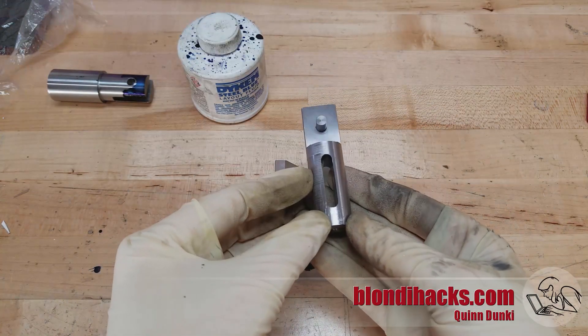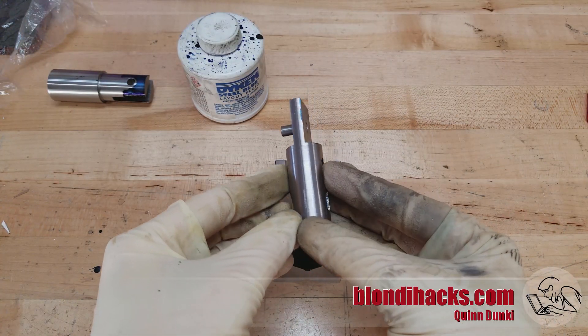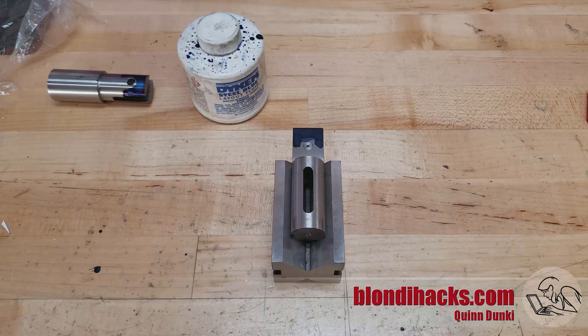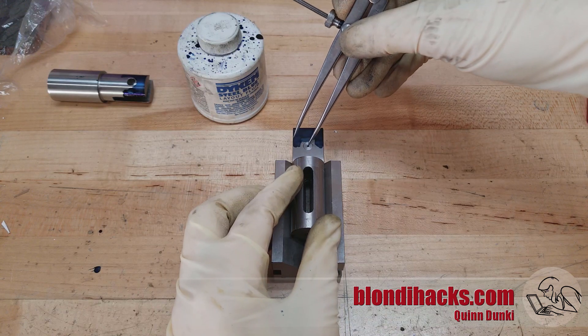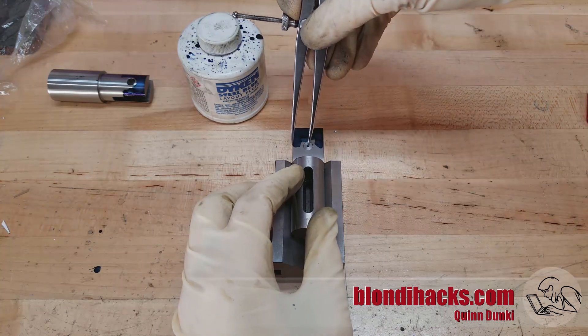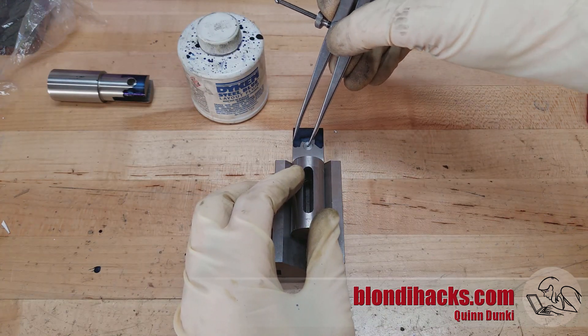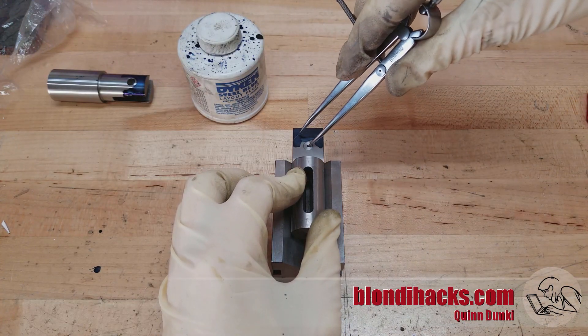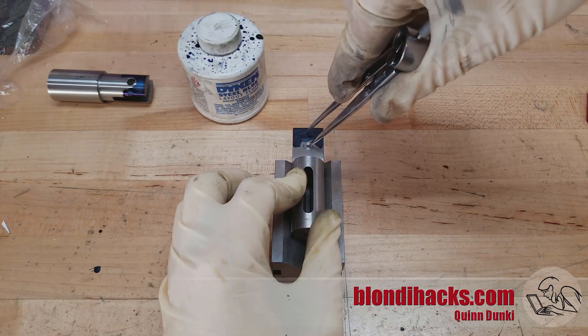To round off the end I made this little pin to fill in the center — quick lathe project — and that center punch will give me a place for the dividers. I can just go ahead and scribe the arch that we're going to want on the end of this part. This works fine on the rounded end part, and you can see one in the background there as well.